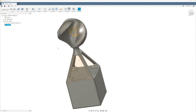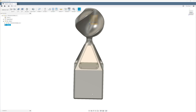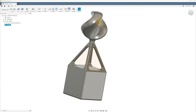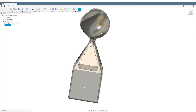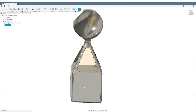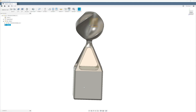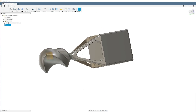The part is sitting in the vise down here. You're outside the machine looking at the part in the vise. This is C-axis if you have a UMC or a DMU, and this is B-axis. You need a good understanding of how the rotations work on the axes. The first thing we're going to do is flip it around and flip it down — that's the first cut right there.